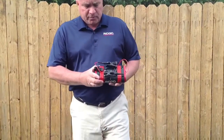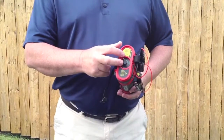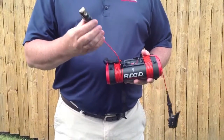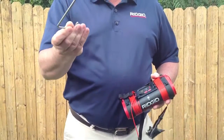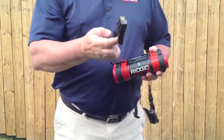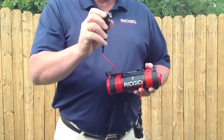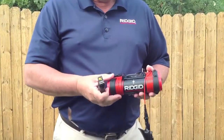Some of the features of the Brick Transmitter: first off, it's battery-powered. It takes six C-cell batteries, which mount in the side of the compartment. You also have two metallic clamps. They're universal — one clamp you hook onto the utility, the other you mount on the ground rod, which we include in the unit. They are both magnetic as well as clamping. There is also a small file on the end for you to scrape off any rust or paint, enabling you to get a better connection and send a better signal through the line.